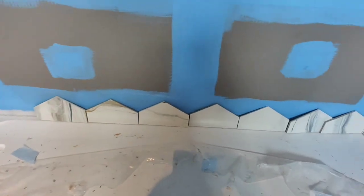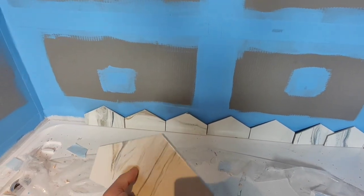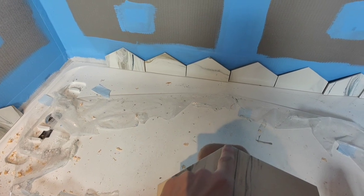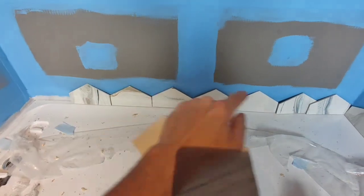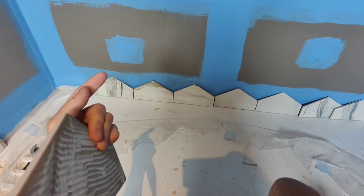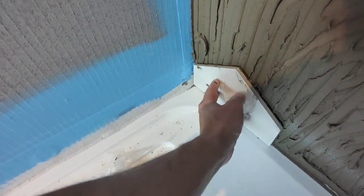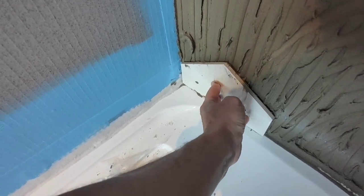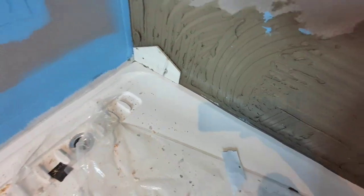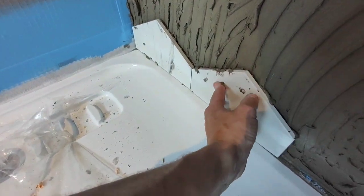I need to set the laser up and get a line because this tray bowls a bit. I need a line on here, set up on the highest point, and then lift these up if needed after. I'm thinking the high point is probably going to be in the middle because the tray goes like that anyway. Josh has been buttering a few of these up — I'm doing front and back of these ones just to get a good fix and level them out a bit better. I'm going to stick them all on for now and then get the laser on once they're in position.